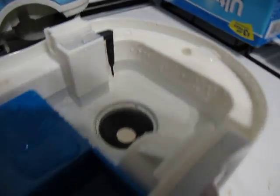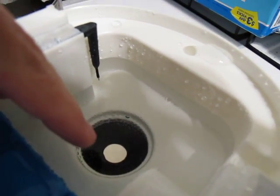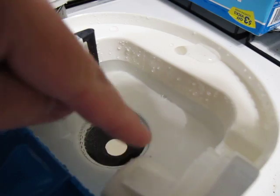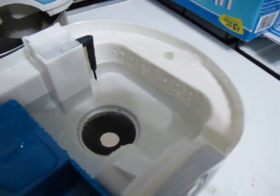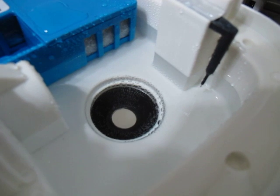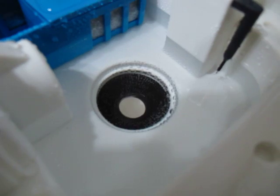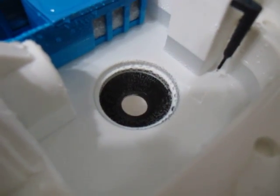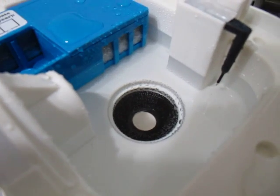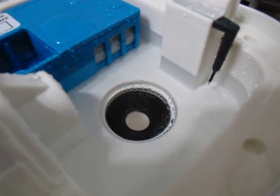Here is the part — the unit itself, right inside there. That shiny little disc right there in the middle of the black seal actually creates the ultrasound. This is an ultrasonic transducer. These are also made in larger, industrial sizes, which would create much more volume of vapor.